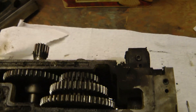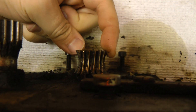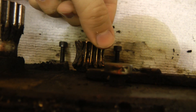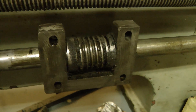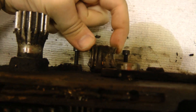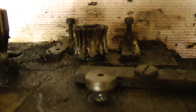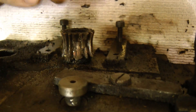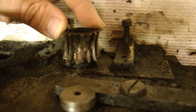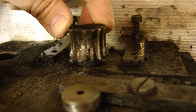The bigger problems are on this gearbox. The biggest one is this gear is stripped — the one that is driven by the power feed gear. Someone must have jammed this up and stripped out this gear. I think there's a lathe made by Grizzly that is very similar to this, almost identical — seems to be a slightly upgraded version — and I hope the spare parts for that will fit this. If not, I'll try to somehow make a new gear, though that'll be a big project.